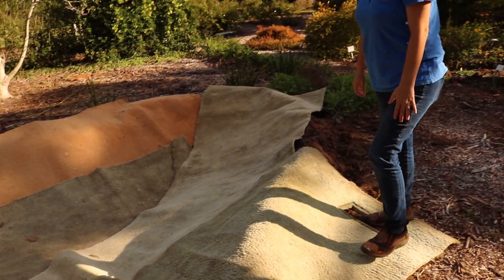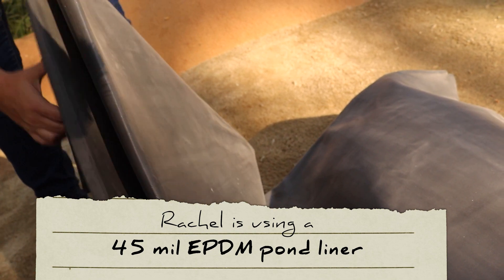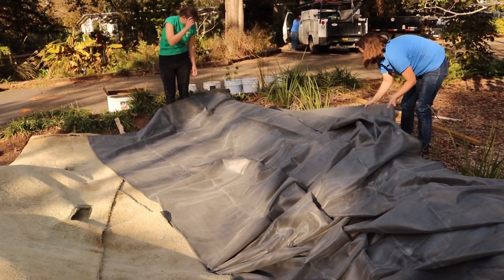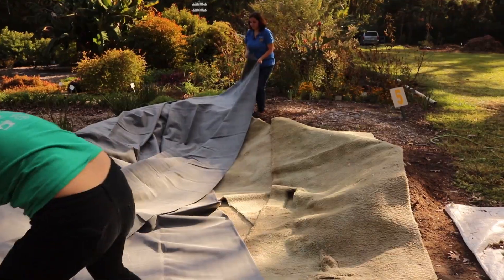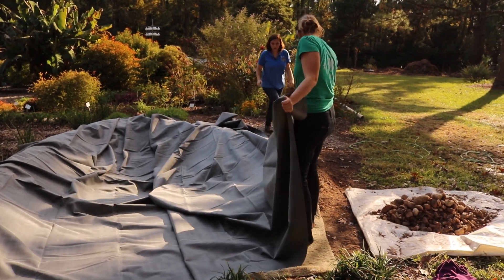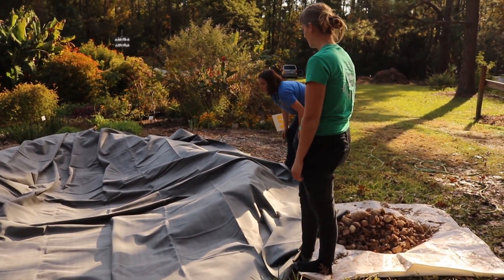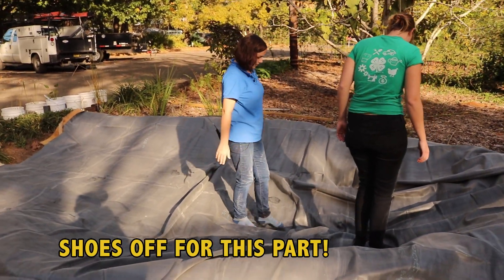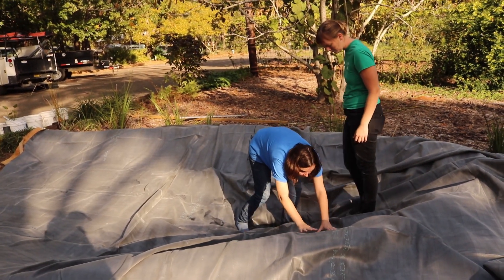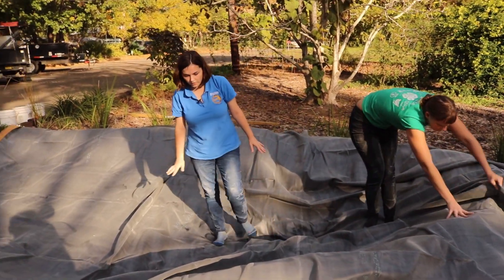It's like we knew how big our pond was. It's basically like inner tubing, which is really what it is. What it does is it keeps the water from percolating and going through the soil too quickly. We want to pull it so it's a little bit over the berm — we want a little extra. We're going to leave it kind of loose, pull it tight over here. It's almost perfect — well, it will be perfect. Get the deepest part, get those contours in. Our berm is here and we've got plenty. It's always better to have more liner than you think you'll need.